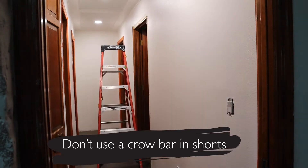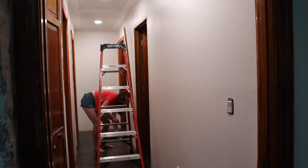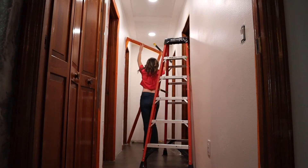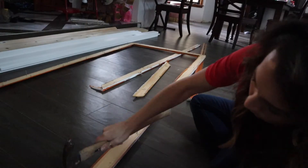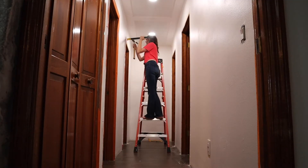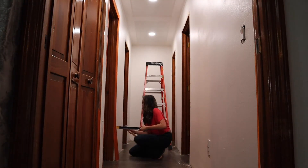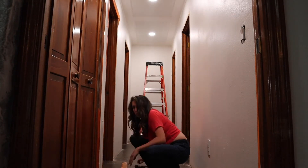I'm finding the nails behind the baseboard and pulling it off the wall with minimal to no damage. Look at this one — it came off completely in one piece. I'm taking the molding off and then using my hammer to hammer down the nails. This is essential, not only as you go along, but for safety if you're putting it on the curb — you don't want those nails sticking straight up.